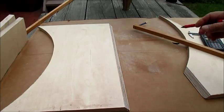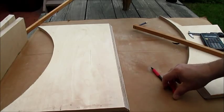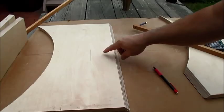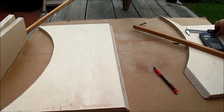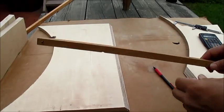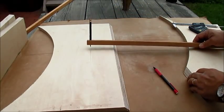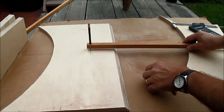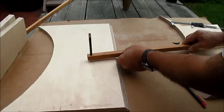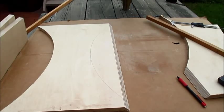To make the north bearing, I've already cut the bevel on the edge of this piece to the complementary angle of my latitude. Now I want to draw a line for the sag of the curve, so I want to draw a radius that I've marked out here with a pin stick — very simple — and then make sure that the crest of the curve falls on that line and draw that out. Now I'm going to cut that out with a little bit extra and then go from there.